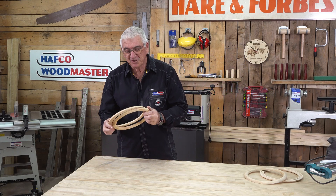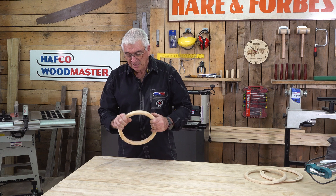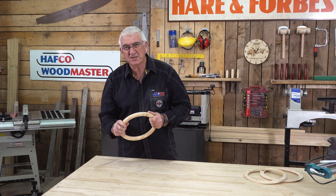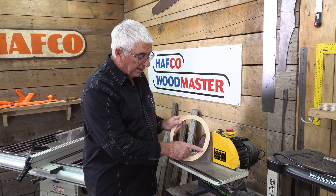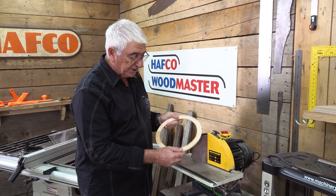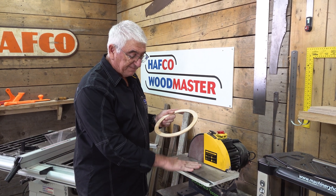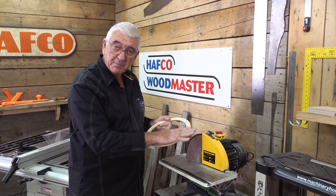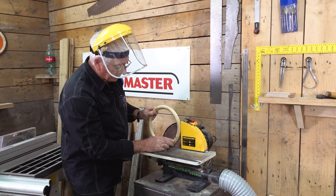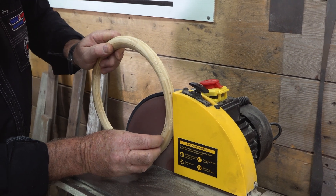Fantastic — you've now got your two halves of your steering wheel and they line up perfectly. If you find that you've got a few gaps or anomalies, we'll show you how to fix those. If you have a small step like what we have here, I'll show you how you can fix it either on a disc sander, on a flat surface with a bit of sandpaper, or with a hand plane. I'm going to place my material on the disc and slowly rotate it to remove that step.